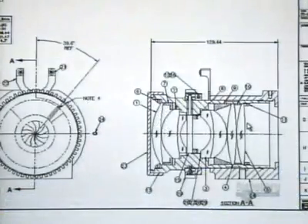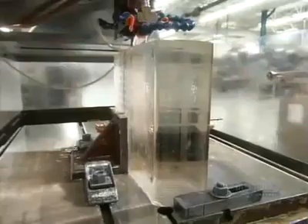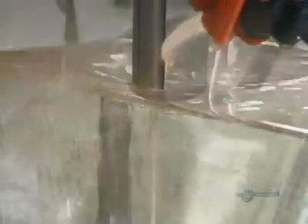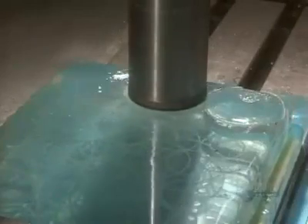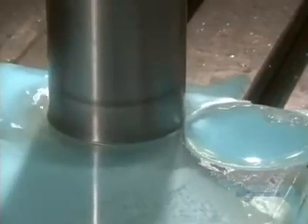These television lenses start with a very precise design. A diamond blade slices up a block of specially selected optical glass, while coolant prevents the blade from burning it. The slices then go under a diamond drill which cuts several puck-sized discs from one glass slice. The operator is careful to keep waste to a minimum.